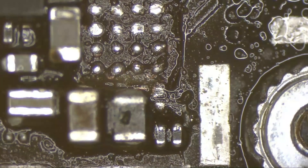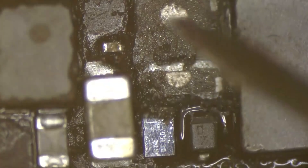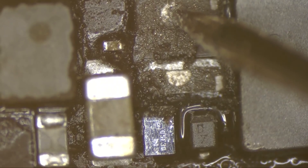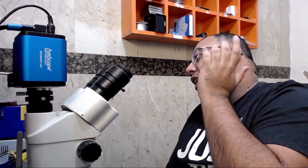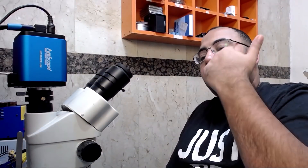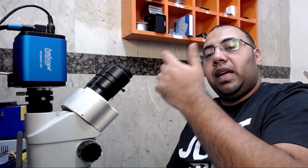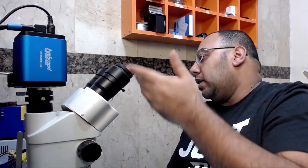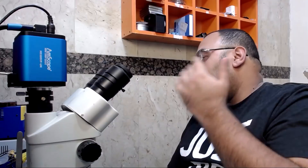Let's check the resistance for VCC main now — it's 300, okay. Let's try to boot the phone again. It's not booting at all — it's just like 10mA, 30mA, 40mA, 50mA, 80mA, then drops again and repeats.